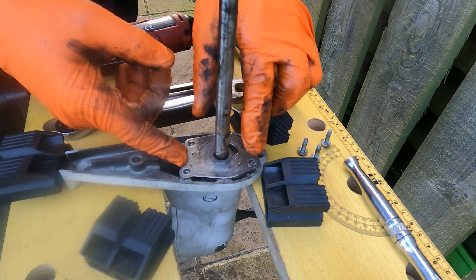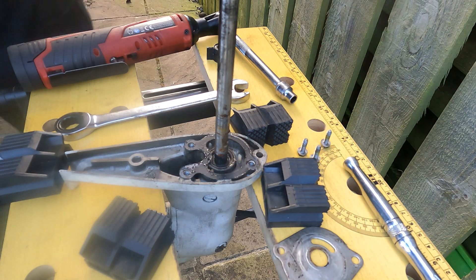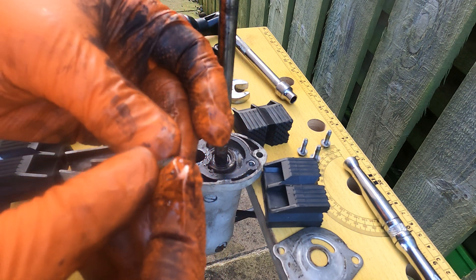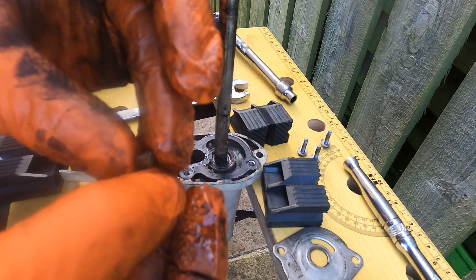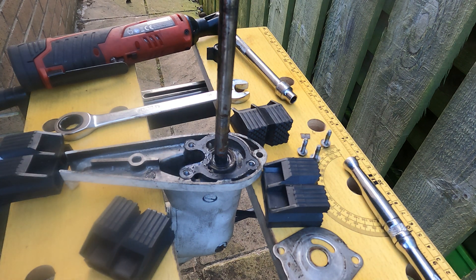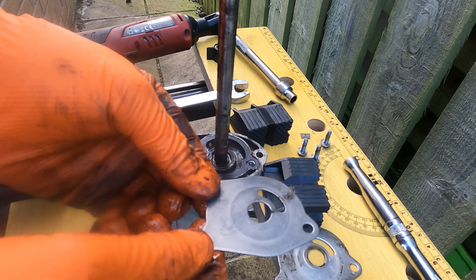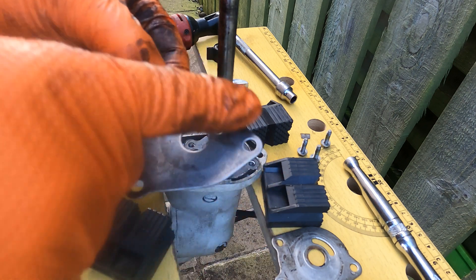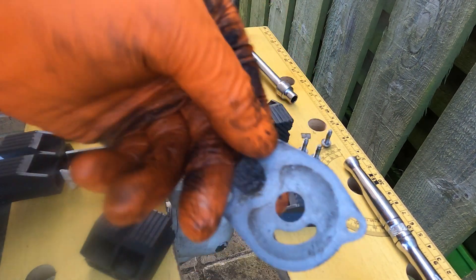With the impeller off, we'll take this wear plate off — it comes off in one piece. Remember to keep the orientation. It's a good idea to inspect the cam — there's a profile cut into it, and sometimes the impellers can almost jump and ride over the cam. This one's looking alright. Normally you get a new one in the kit, but this is aftermarket so we don't get one. When you take it off, always put it down in the position it came off in so you know the exact orientation when putting it back — you don't want to put it in the wrong way around. Checking the top — there is a gasket on there and it's in good condition.